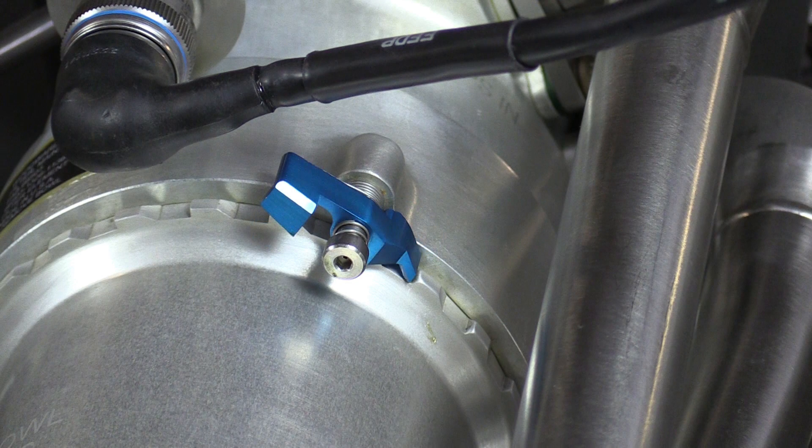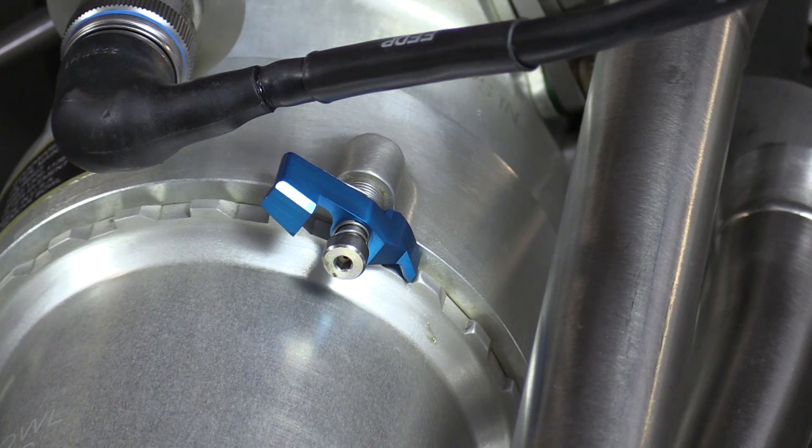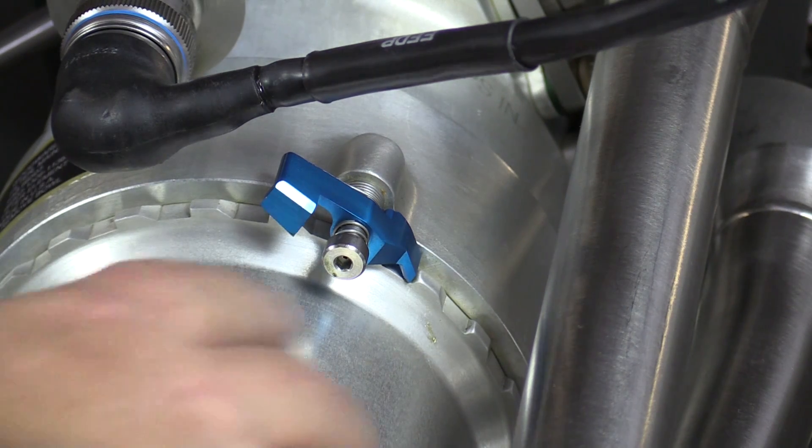Now we need to re-seat our ratchet lever. Pull it down and release it so that it is in contact with the lock ring on the filter bowl. It's not necessary for the ratchet lever to be down in the groove between the teeth — it is acceptable per the aircraft maintenance manual for the ratchet lever to be up on top of a tooth. We just need to verify that it is actually in contact with that ring. It's critically important that once you have the filter bowl seated, you never tighten or loosen it to try to get this ratchet lock aligned. That's perfectly acceptable per the aircraft maintenance manual — but once it's seated, we don't ever want to tighten it or loosen it back up for alignment with this lock.